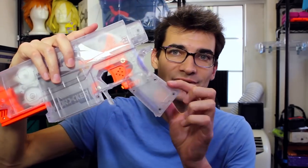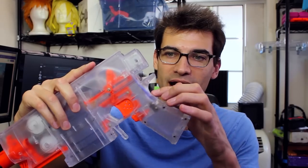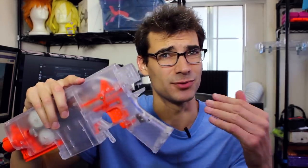That 12-amp switch isn't the worst in the world but it's definitely not ideal, and that's a concern I'd like addressed in the future. Also, you're so close up against the back of the grip that — I'm using 16-gauge wire in here — you have to just shove it in there and it does not feel good, secure, or safe at all. I really wish they would have moved things in a little bit further or pushed the grip back out a little more to give more space.